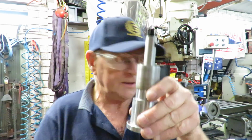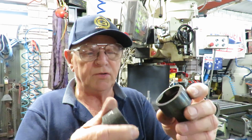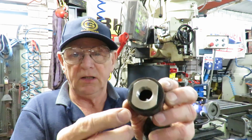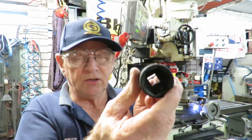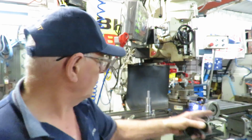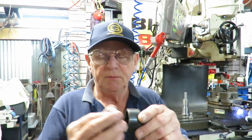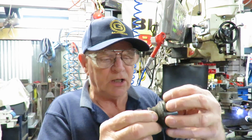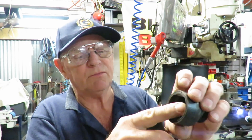So that's a success story from today. Another item we've got on board is making more of these sockets — I've shown these before. These are sockets for opening and closing the special nuts that I make for impellers. I take a regular impact socket, machine it, and I've got one on the mill at the moment behind me. I mill it out to make those extra ones. Part of what I have to do is make another socket that goes over that, and then I TIG weld it up to give it stiffening for a very thin edge.